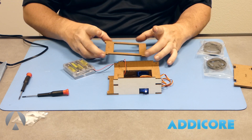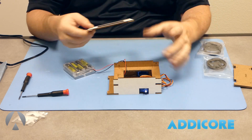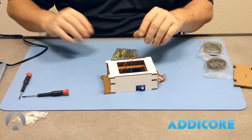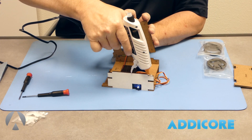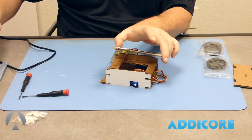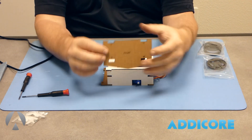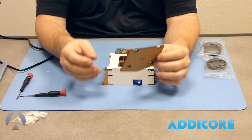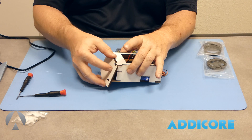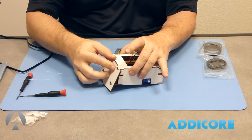The last piece is getting the top on. The top has letters and a notched area on one side and is flat on the other — the notches go to the front of the robot. Feed the battery compartment through and orient the white part to the outside for a clean finish. Run glue along the edges. How much glue you use is up to you, but if you're going to use the bot in sumo competition or build one with a weapon, put a lot more glue in to keep it strong. Now the front blade — it says 'front' on it and also has notches and letters. Put glue on the tabs, fit them into the notches with the white side facing front, and tack it in. Add a bit more glue on the attaching pieces, pop it in, and let it dry.